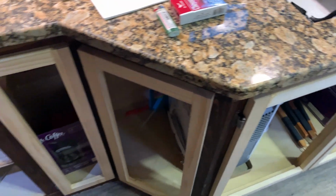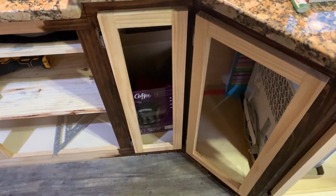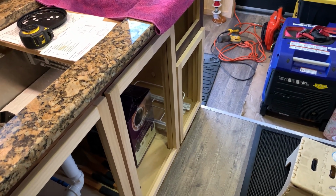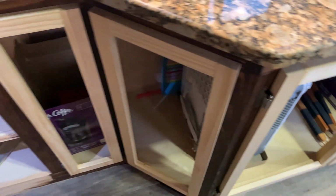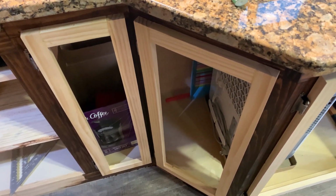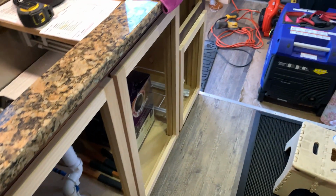Okay. I bought all of the hinges that Lowe's had, so I'm gonna have to go to a different store and get some more, but I had five left, and that's how many doors I had, and there's two in a package, so it worked out perfect. All right, let me get these taken off. I'm gonna take them outside and do my routing and start to install my tongue and groove. I want to get these all tongue and groove today, and sand them and shellac them. They can dry tonight, and then tomorrow I can hang them up and be done with them.